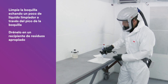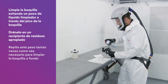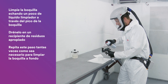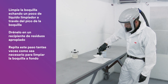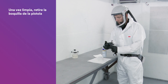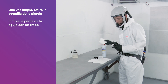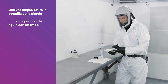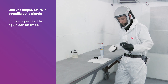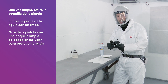You'll repeat this step as many times as necessary to make sure that the coating is cleaned out thoroughly from that nozzle. Once the nozzle is clean, you can remove it from the spray gun. Go ahead and grab a rag — sometimes it takes a little bit of extra solvent to clean the needle tip, but give it a good wipe. Then store the spray gun with an atomizing head attached to protect the needle.